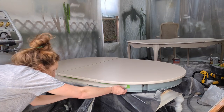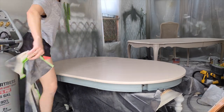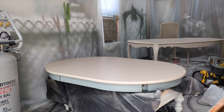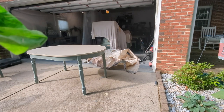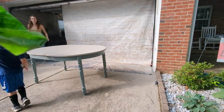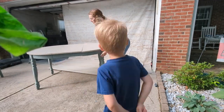Back in my workshop, I was able to take the tape and cover off the lacquer and the tabletop was complete. I'm sorry I didn't show you this process — I definitely showed it on my Instagram. Just like in a lot of my other videos, painting a tabletop is the same process as painting furniture: first the shellac, then the paint, and then the top polycrylic satin-based seal.